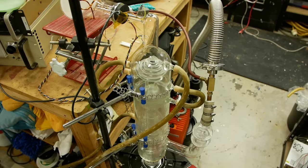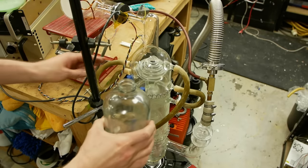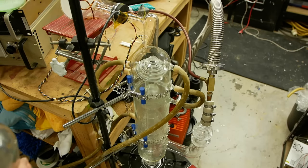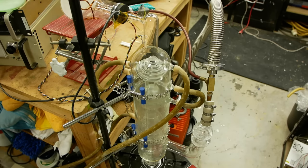As you can see from the demo, this pump does have a design problem — it's got a small mouth. The body of the pump is large diameter, but the restriction up here is a pretty big problem. The body of the pump could be connected to deep space and we still wouldn't be able to pump everything out efficiently because of this restriction, so this pump really is made much more for demonstration than actual use. Real diffusion pumps made for serious work are made out of metal and the mouth is as large as the pump diameter — as big as it can possibly be. And the cool thing is this scales up very well — if you have a huge vacuum chamber the size of a room, you can build a diffusion pump that's also as big as a room and it still works the same.